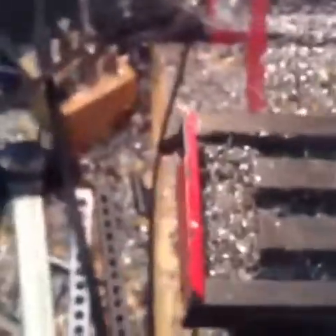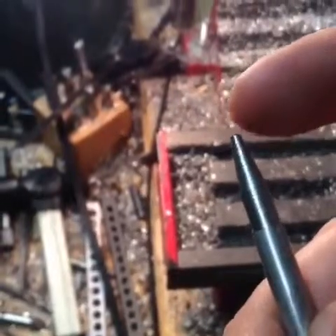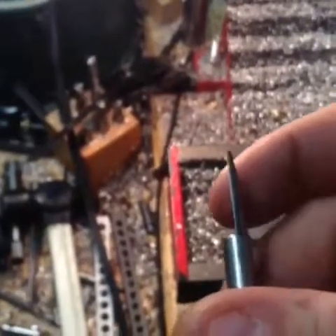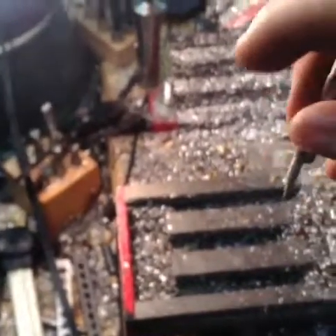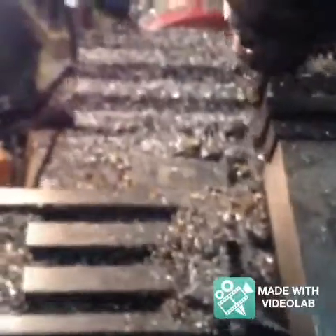If you go a little bit too much there that really doesn't matter because all you're going to have is a little bit of a relief. That part's done - we have a finished cutter. I just made it on the other end of my other cutter, but there it is. Take a belt sander and touch up that point to make it nice and flat. It's exactly half-and-half according to the measurements, and that is a complete cutter. Now all you've got to do is make your square blocks, drill down into the block until this is totally buried right where the tip is, put it in your mill, drill a relief cut to the depth of your flats, and use this to cut the cone. I hope that helps.